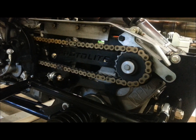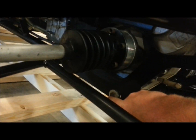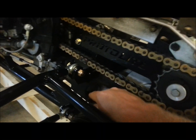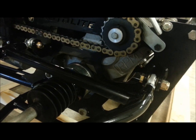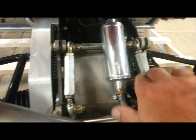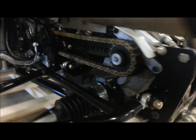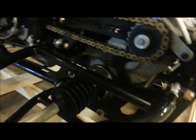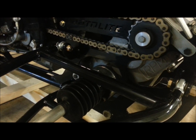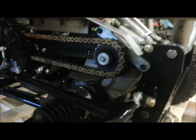What we designed with this engine cradle is that you can loosen up four bolts — there, there, down there, and right down there. Those lock the RPM gearbox in place, but for adjusting chain tension you loosen those up and come back here to these turnbuckles. With those loose, you can adjust these two turnbuckles to pivot the whole RPM gearbox forward and back to adjust for chain tension. I always recommend running good chain lube on the chains. When you're done, tighten up your turnbuckles and then tighten up the four locking cross bolts also.